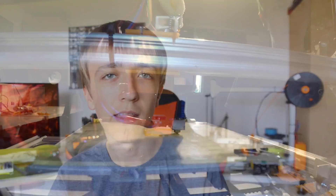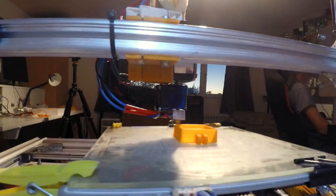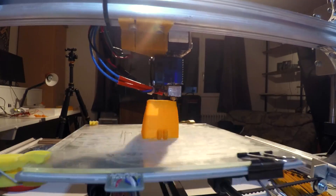The next thing I already mentioned in the last video is a part cooling fan. The printer originally came with one, but it didn't have a shroud, so it was just a fan blowing lightly over everything. So I just printed a shroud using the STL file from Thingiverse, linked in the description. After I printed it, I cut off the mounting part as I didn't need it. In order to get the best cooling performance, I also adjusted the settings in my slicer so that the fan is always blowing between 70 and 100% instead of 50 to 100 like before. That way it is a bit louder but also more effective, as the shroud does restrict the airflow a bit.